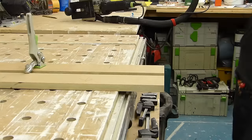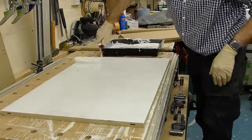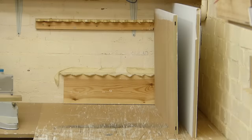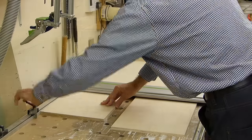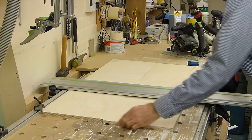This carcass is made from 18mm or ¾ inch MR MDF and has been cut to size and marked up in the usual way. Jointed for dominoes and primed, it's a simple cabinet comprising a base, two sides, two top rails and a loose top that overhangs the drawer fronts and will be scribed to fit during the installation.